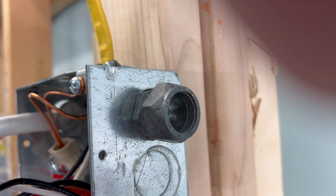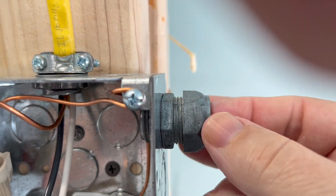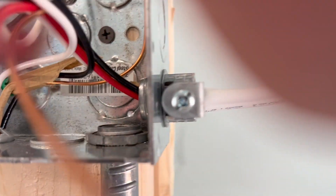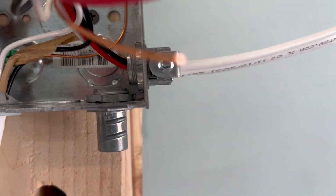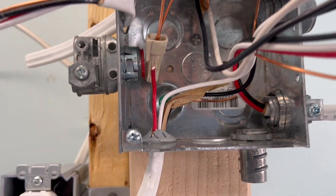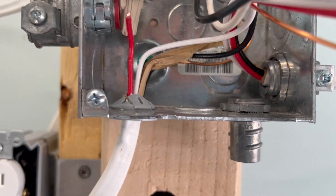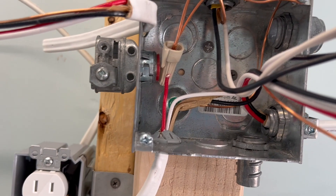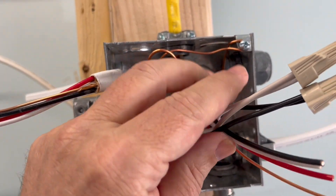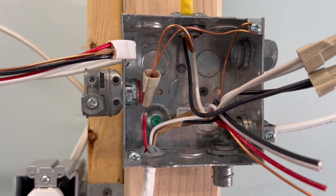Over here is a compression connector — you don't put Romex in that either. That is meant for EMT or conduit. It's a compression watertight connector that clamps down so no moisture or condensation gets inside the pipe. This here may look like a Romex connector, but it is an MC connector — you can tell by the big opening inside. That big opening means it's for MC cable and must have an MC bushing on it as well. This other one is a flex connector. You might think a Romex just going through a sleeve into a box is good, but if somebody pulls on the wire it pulls out of the box, the hot wire hits the box, and you have a short.